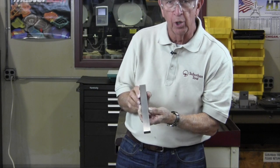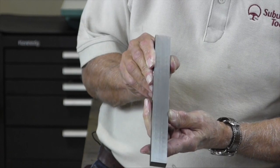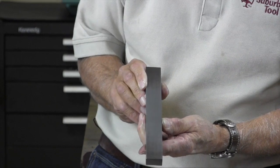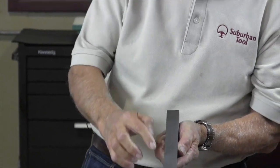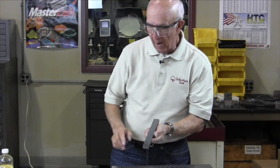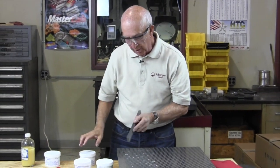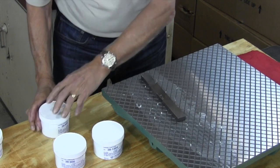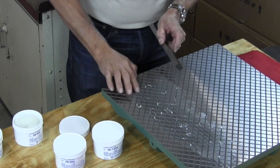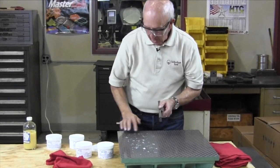I'm rocking that around so we'll get the light to reflect off of it right. What I'm seeing is it's hitting on this corner and on this corner, and not so much in the middle. We're talking probably a half a tenth, maybe a tenth, so it's not much. We're going to stay with this 600 compound — that's pretty fine — and I'll get another little charge and do it again.